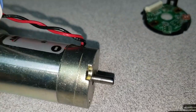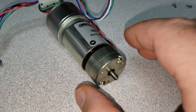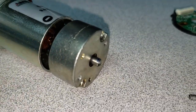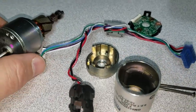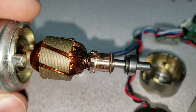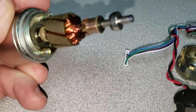If this is old enough you could actually shear a screw if you're not careful. I haven't attempted to pull it apart yet — I figured I would share that joy with everybody. Very carefully, one-handedly, we'll slide this off. It looks like I probably buggered the end of that shaft up just enough where the set screw was. Here we are with everything pulled apart — the bearing ended up hanging on that point and pulling out of the housing. Looking at the commutators, there's no obvious evidence of anything burnt on the armature, so the motor itself is probably still okay.